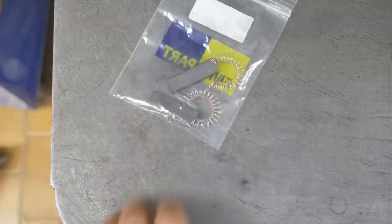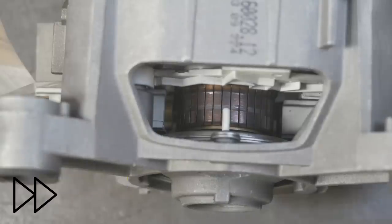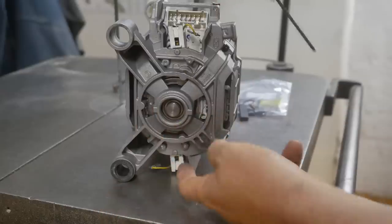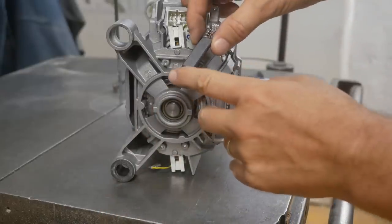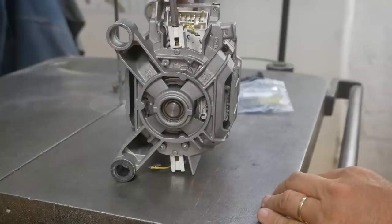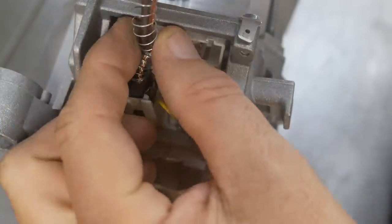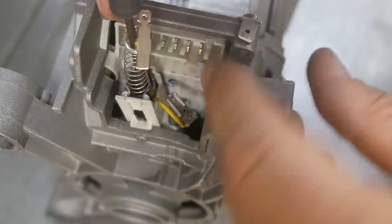The new brushes have arrived — that was fast. Just polish up that armature a little. I'm not going to get that ridge out of the middle; it's too deep. You can see the offset in the brushes, and they've already got an angle on them so obviously it goes in this way. These springs are pretty flexible. The tip from the YouTube video is just use a screwdriver to align it.